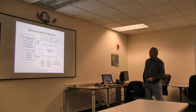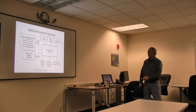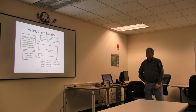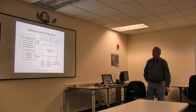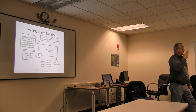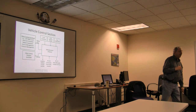So this is a fun project. We've been working on it a while here now, and we're into it. So we control the video camera platform, and we control other interfaces as well. Transmit level from the UHF transmitter. Thing gets hot. It transmits 5 watts, but it dissipates 20. And so it's cooking. And we have to take the heat out of that. And that's going to be a trick.